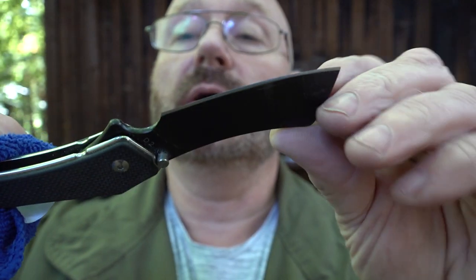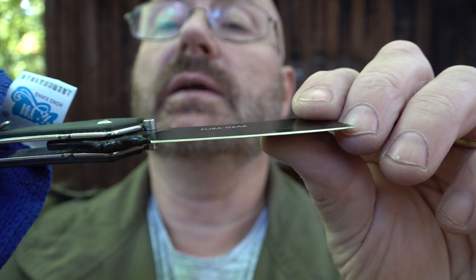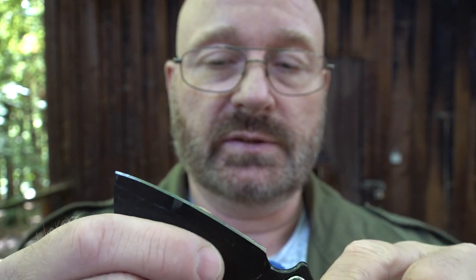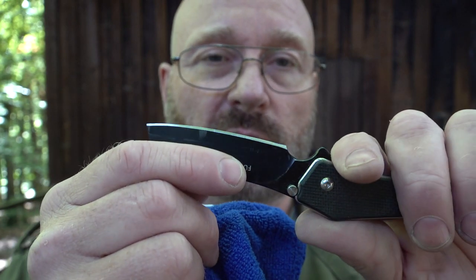As you can see, the knife is now in very good condition already — no more nicks, and it is already sharp. But of course it's been ground by the rather rough stone, so now we do this with the finer stones until we have a polished, mirror-like edge.